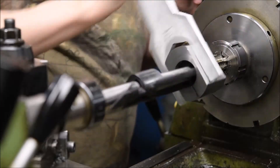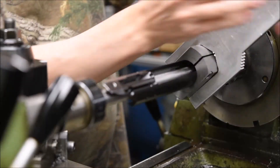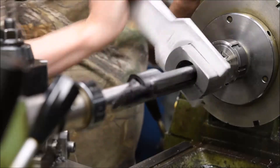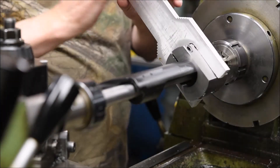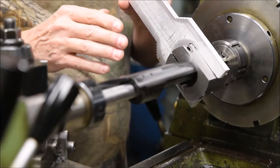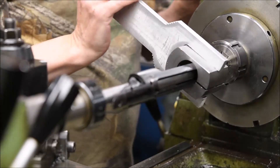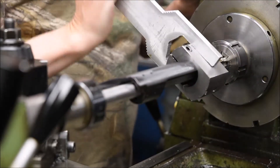The action will have hard spots in it. All of the thin areas of the receiver during heat treatment will get harder than the thick areas where the recoil lugs are located — those areas are going to be soft. Conventional cutting with a single point cutter and a boring bar doesn't work that well because the cutter tends to bounce out when it hits the hard areas and dive in when it hits the soft areas. That's sort of exactly why the threads are screwed up to begin with — Remington tried to cut them all at once with their tapping heads, and of course they dove in the soft areas and pushed away in the hard areas.